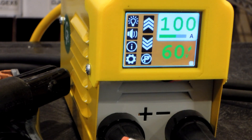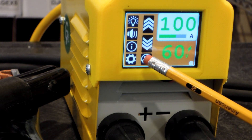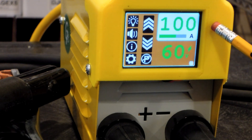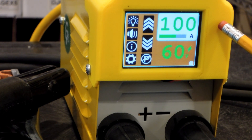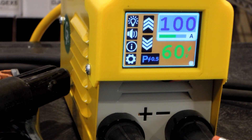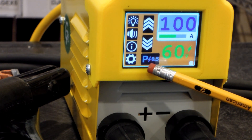Pulse mode is a feature that's typically only found on very high-end stick welders, TIGs, and MIGs. What it does is interleave the main current with a background current. I highly recommend checking out some YouTube videos about stick pulse welding — there's a Chucky 2009 video that does a pretty good job of explaining it. To turn pulse mode on, just go ahead and push the pulse button.